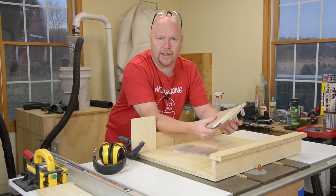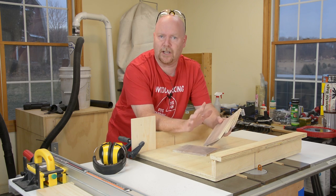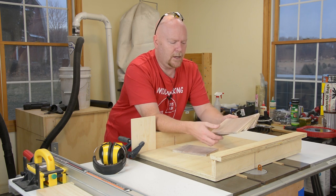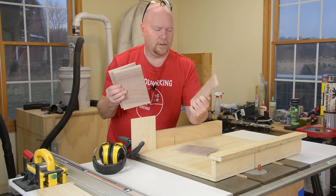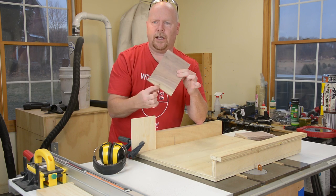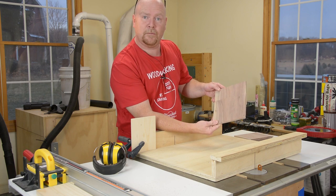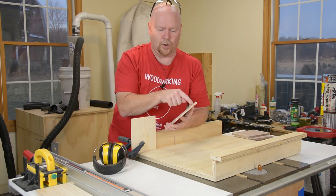Before I break this down, let me show you what I mean by trying to get these things the same. I set up my stop block for my 5-inch dimension. Three of the shelves are 5x7, and the top shelf is 5x5. I'm going through them and, as you can sort of see, these three are a pretty good match — they have a little bit of sapwood on one end and a little bit more on the other. But this one right here has a big hunk of sapwood on the bottom and nothing on the top, so this is the one I'm going to cut the 2 inches off of. Up at the top I've got some little knots and pinholes, so that's what I'm going to cut off.